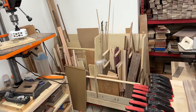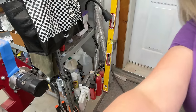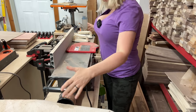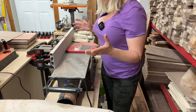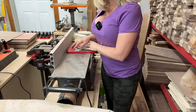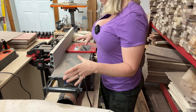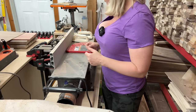In that corner there's a little storage bin for scrap wood that I built — it was one of my first projects. All the shop furniture I built myself. Then here I have all my parallel clamps — well, some of them — and a lot of little clamps hanging on my shelves. Over here we have my jointer. This is a small jointer — the Wahuda 8-inch. It has a cast iron table and a helical head, and I absolutely love it. It works so so well. It is a small jointer, so if you're jointing anything over about three and a half to four feet it becomes a lot harder, but for smaller pieces this works really really well.